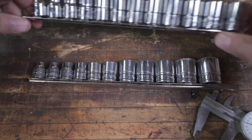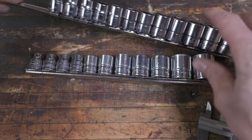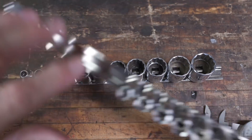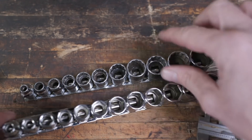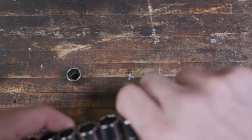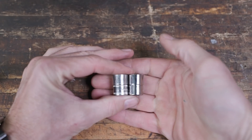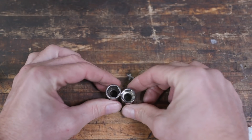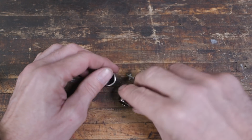Let's compare the Snap-on and the Williams sockets. They both came shipped in the same type of spring container — Snap-on's was shorter, Williams was a little longer. I've got the metrics here. These are 12-point. 12-point versus 6-point — 12-point means you don't have to turn them as far to drop onto a bolt, but some say they don't last as long. You'll have the 6-point in the Williams. Comparing them side by side, they look very similar and feel identical as far as height inside — exactly the same.